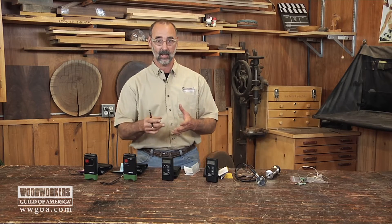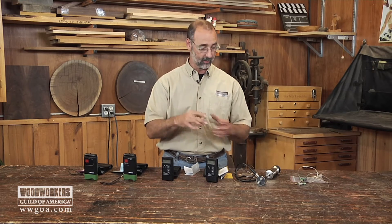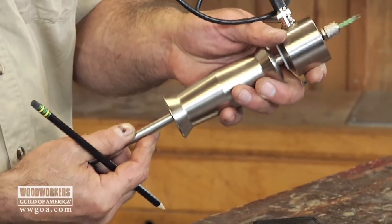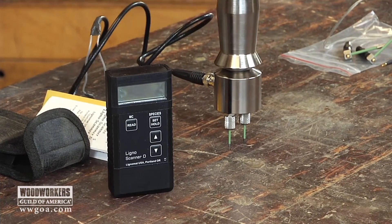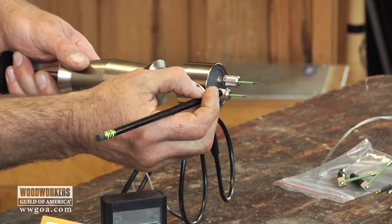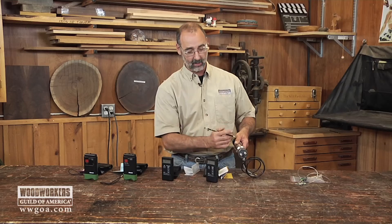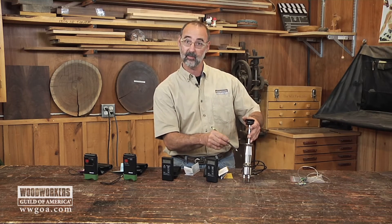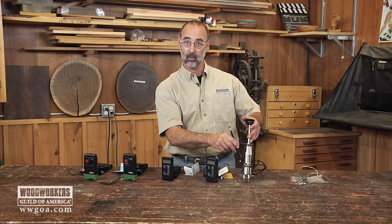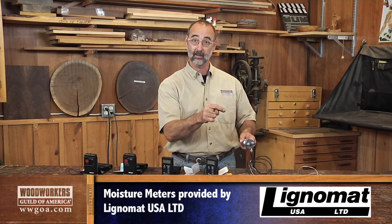If you've got a big pile of rough sawn stock and want to make sure you're getting good penetration on thicker material, then you're ready to look at probes like this one. When I set this on my material, I can drive those probes very deeply in. What's cool is that the pins themselves are insulated, so I'm getting a reading from a specific depth range, not the full surface. On thick stock with just a little bit of penetration I'm getting a surface reading of moisture content, and every time I tap it more deeply I'm getting a reading deeper and deeper into the wood, specific to that exact penetration point. This can give you a lot of accuracy on thicker stock.